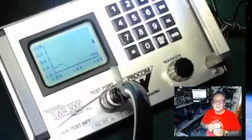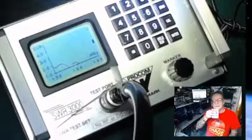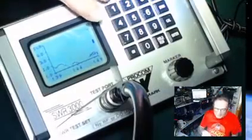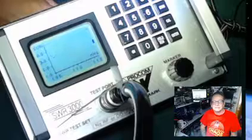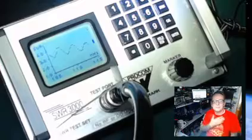Or you can go there and let it calibrate. And there you go. It gives you a nice vector diagram, which is pretty good for that antenna. Now if I was to put it onto another frequency, let's put a center frequency of 110 in, which is way off of where it should be, and skip, and you can see it's pretty rubbish, although it's getting better right up at about 115. So that's basically what it does.